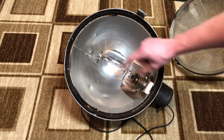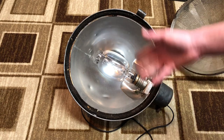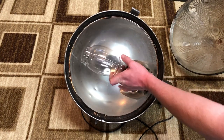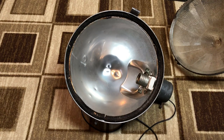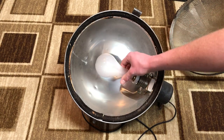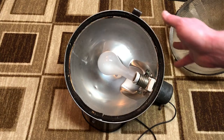Probably a 100-watt bulb might move it a little bit closer, so it's definitely made for a 175-watt or 250-watt mercury vapor bulb, and obviously the ballast would be on the pole in a ballast can. Let me go ahead and take that out because I don't have a remote ballast here with me right now — I only found the fixture; I did not find the actual ballast can at the ReStore. The fixture is way cool all by itself. I'll screw in an adapter here and put in this 100-watt bulb. It looks like a 300-watt bulb, but it's a 100-watt bulb. I chose this one because the filament is almost in the center of the fixture.